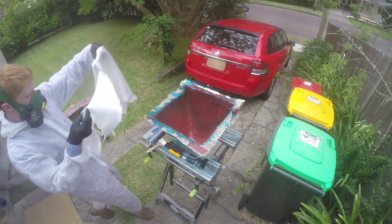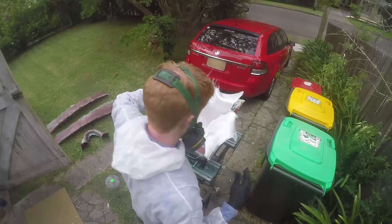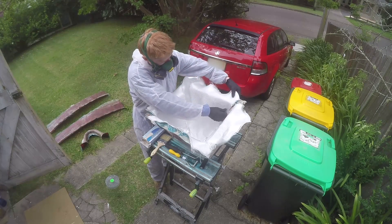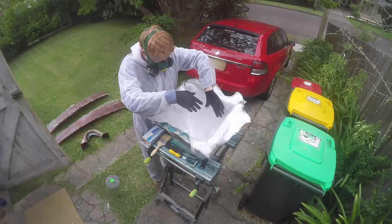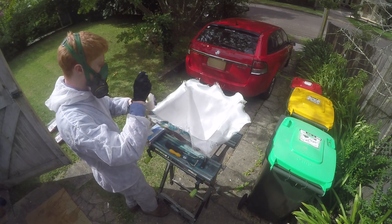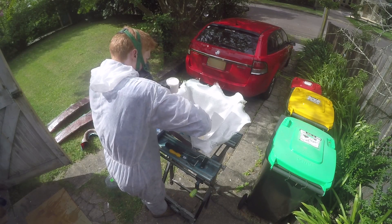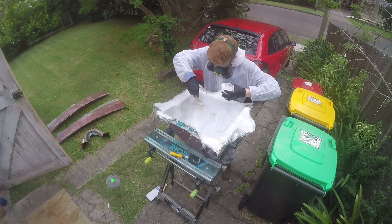Then I laid it up in the mold. This mold had been waxed and coated in a fine layer of PVA release agent, much like the bodywork plug, to allow for an easy release of the part. I used an epoxy resin with a paintbrush to wet out the fiberglass — this I've been told was mistake number one. I should have coated the mold in the epoxy first, then laid the fiberglass over that. I ended up with small pinholes throughout the parts, most likely due to small pockets of air being trapped by this process.